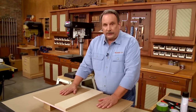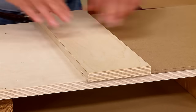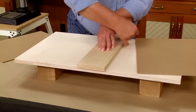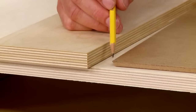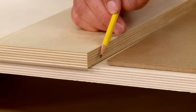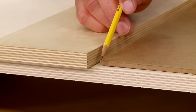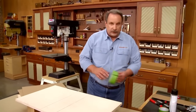All I have to do is mark where these edges are, then remove the two pieces and mark these edges. These marks indicate approximately where I have to cover up the inside section for the insert with no contact cement, but it has to overlap just a bit. You can see that my beveled edge extends right up to the edge of the spacer, but I don't want any contact cement back to the short edge. I'll cover up this inside section with some painter's tape.